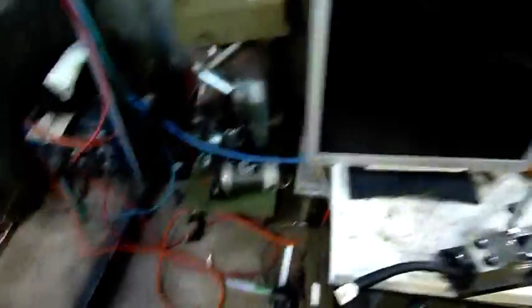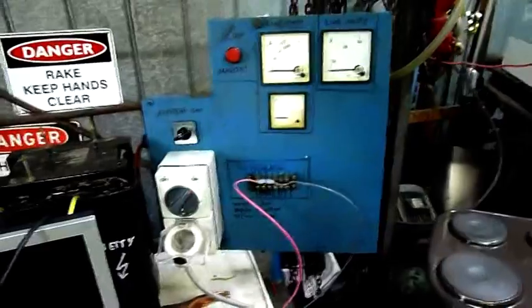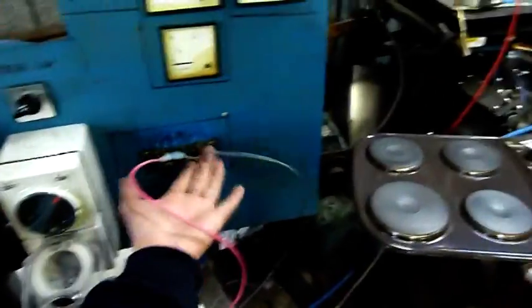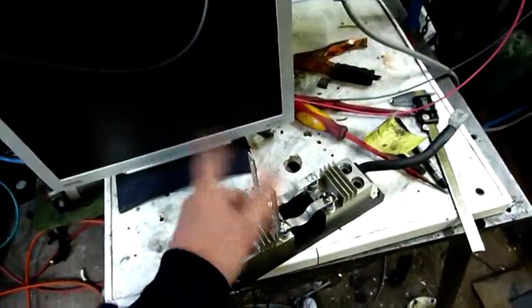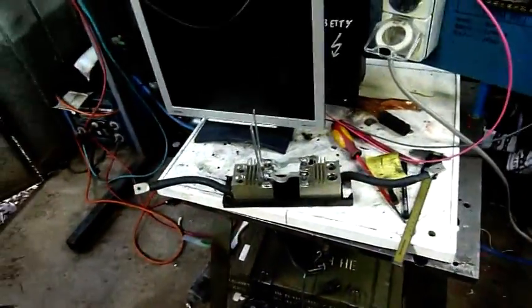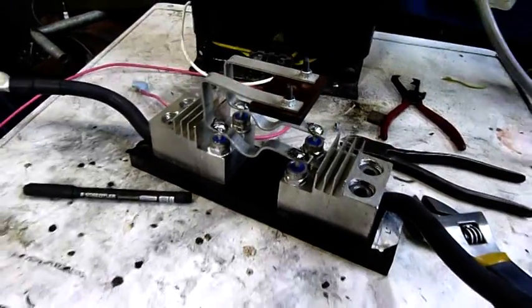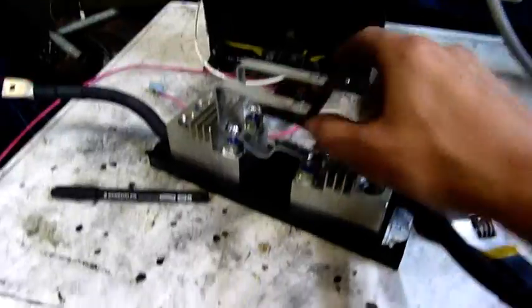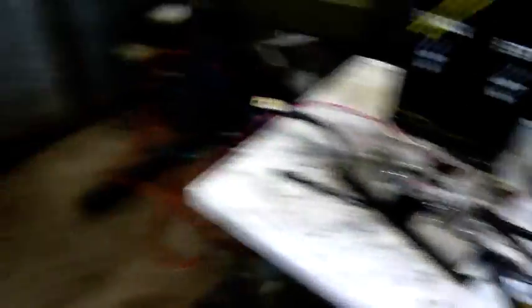So let's wire something up and have some fun. I might try that treadmill motor or starter motor — something big that will show on the DC amp meters or the AC meters going in. I'm going to be wiring through the ballast and coming out of here to the rectifier bridge. That wire is a bit underrated for the size of this stuff but this isn't going to see that much current — I just over-built it for the hell of it. One day it might see some serious amps, like enough amps to melt these bus bar plates.